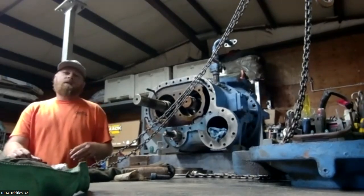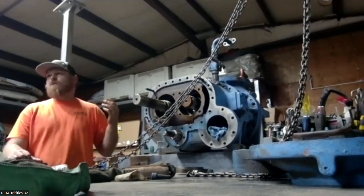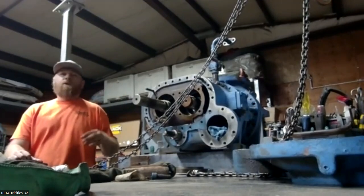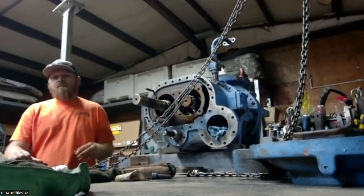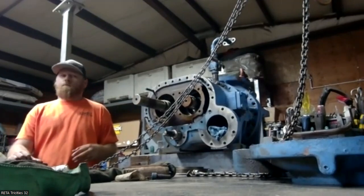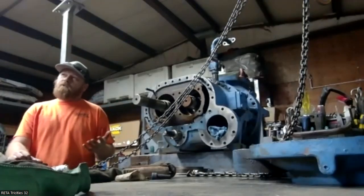Yeah, I was gonna say a lot of times that's true, but from one compressor to the other, it might not hold true with, hey, that one at 48,000 hours was starting to fail, so we're gonna do that one. That one over there might run 80, you never know. I have seen compressors come in with 80,000 hours that should have been rebuilt at 50, and then they wondered why it was making noise and not doing what it's supposed to.